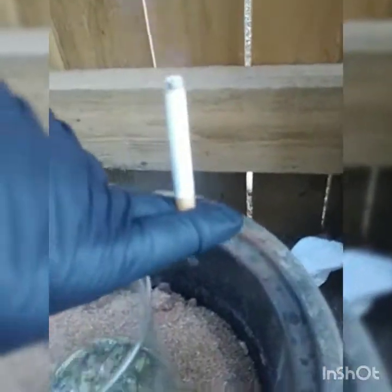You know, I always have to denox, and I do just because. So the free nitric, understanding the aqua regia ratios, 3 to 1, all that good stuff. I add it in small increments too, but sometimes I just take a lucky guess and kind of roll with that. So we have 14 ceramics, 14 mils of nitric, and we'll just start with that.